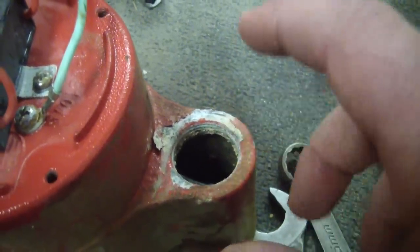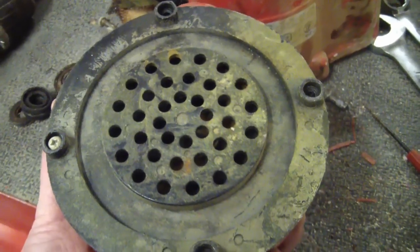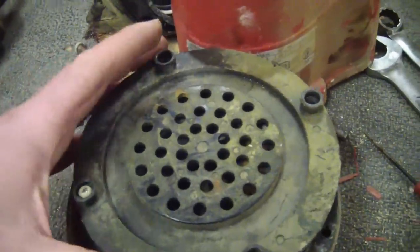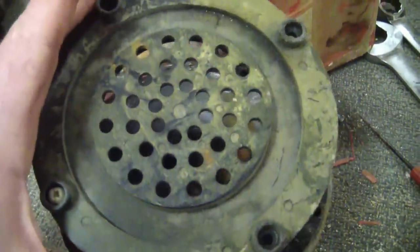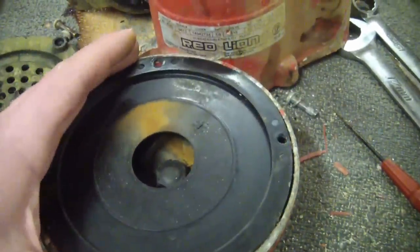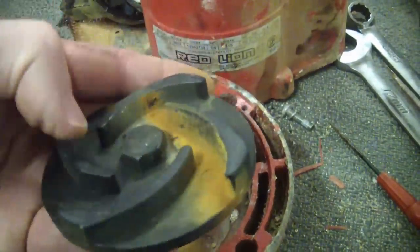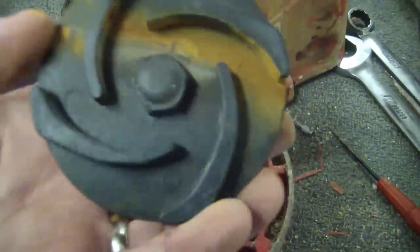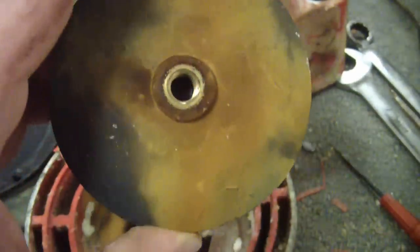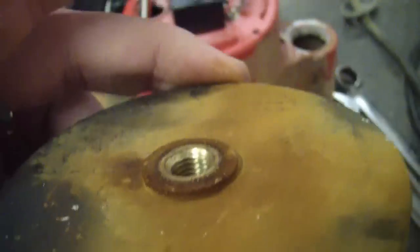There's a built-in leakage path, so using these for hydraulic fittings is horrible, but unfortunately we're stuck with it. To actually get it split apart, we come in through the bottom — there's a nice little finger leaf guard here and four bolts that thread into the aluminum housing so you can take that off and clean it out. There's the impeller — a nice ABS impeller with thick blades. There's no cavitation damage or anything, so obviously well engineered with their flow rates right. It's even got a bronze threaded insert for installing this on the motor shaft.